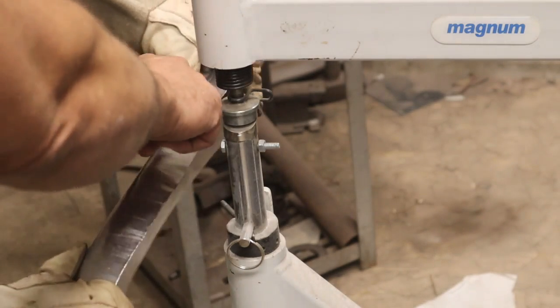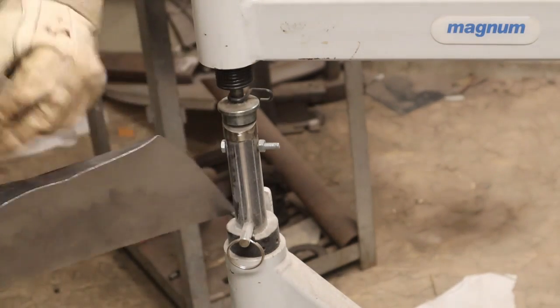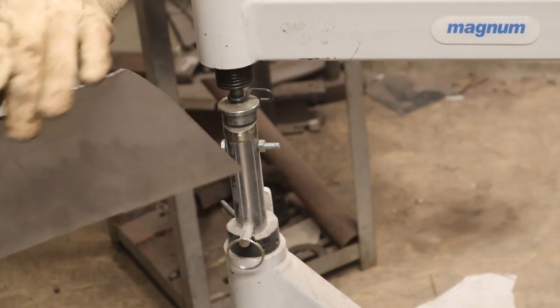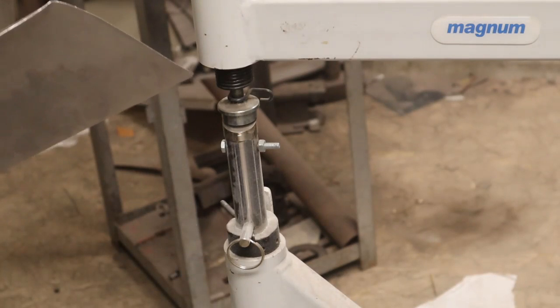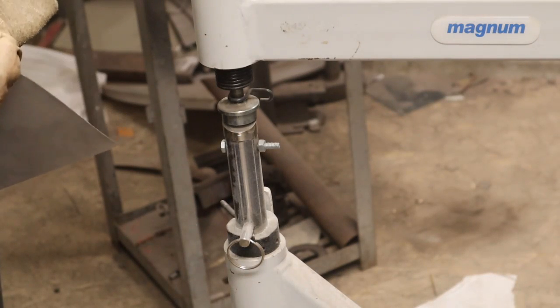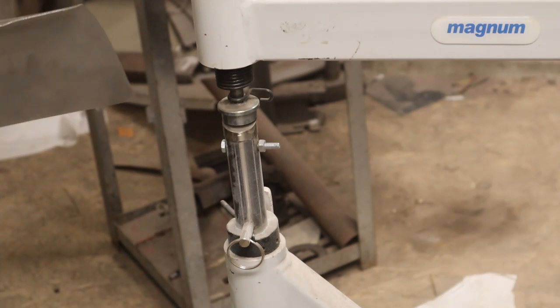Right? But when we stretch it here, will it take this out? Yeah, that's the idea. I see. This is, if this had more metal in it, it would want to go like that, wouldn't it? Yeah. If you were to cut a slot in here, think of it this way: wherever you got to expand it, you would have to cut a slot to make it do what you want, stretch it. Where you'd have to cut a slot so you could overlap it, shrink it.